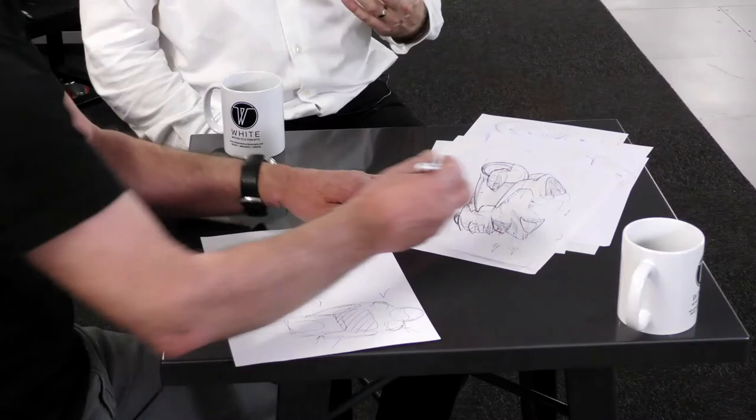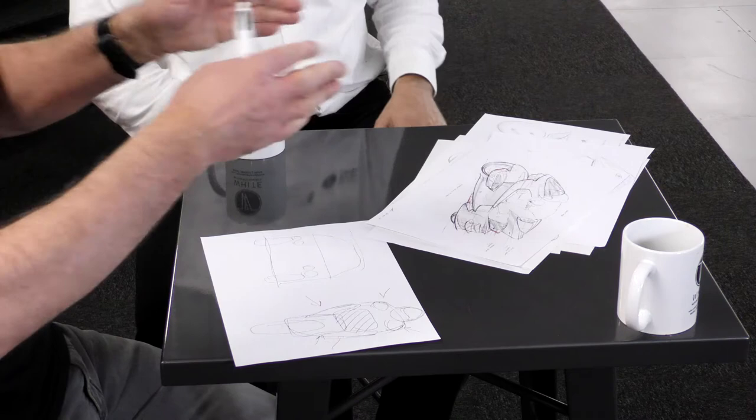Trying to create styling features or shapes which optimise and reduce the drag as much as possible, while still managing to keep it interesting — it's a massive challenge. We were trying with these cutouts here to avoid a big blobby nose, but they were just tripping the flow, both externally and within the duct. Because it's not just the outside we're trying to smooth — we're obviously trying to keep the flow straight inside for efficiency too.